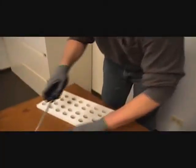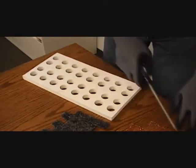To demonstrate this, we've prepared a 1 by 6 inch piece of lumber. We've drilled several 1 inch diameter holes, and we'll fill some of them with Xcluder Fill Fabric and some with copper mesh. For similar size holes, you'll need only about 1/10 the length of Xcluder as you would for copper mesh. For this demo, we've cut 10 10-inch pieces of copper mesh and 10 1-inch pieces of Xcluder.